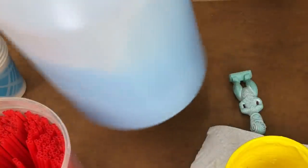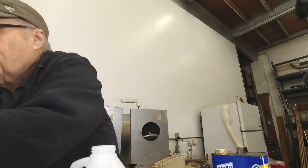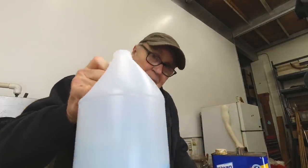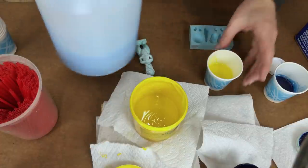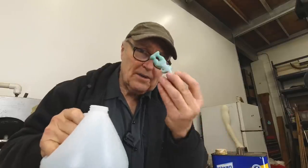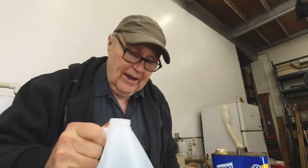It's really light, so it's going to want more. I know it's going to need more because it's going to dry a lot lighter. So let's keep sneaking. I keep lots of paper on hand to keep swiping the cups so I keep my mess under control. Keep stirring. Now it's nice and blue, but I know it's still too light. I'm going to add just a touch of yellow — not much, going to be judicious. I want this to be seafoam, this color, which is a lot of white — the color of the resin. That's about the right ratio. It is now going to be time for our first measure test — I'm going to weigh out a tiny amount of each one and test it.